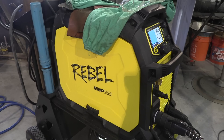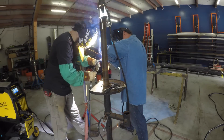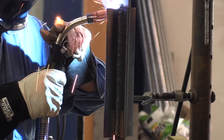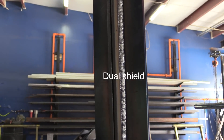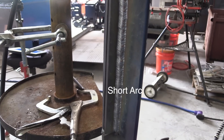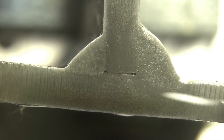To lay the groundwork, let's first do a quick review of the last video using this ESAB Rebel 285 where I compared dual shield flux core to short circuit MIG going uphill. Because of the manipulation you need to do on short circuit MIG just to help the puddle lay down flat — my method for going uphill keeps the bead from crowning up too much — it just slows travel speed down, whereas dual shield travels in a straight line and deposits more metal. The cut and etch test revealed some satisfactory joints.